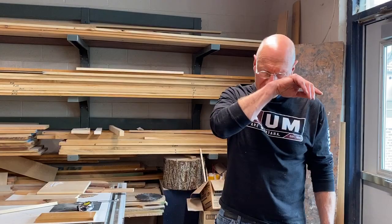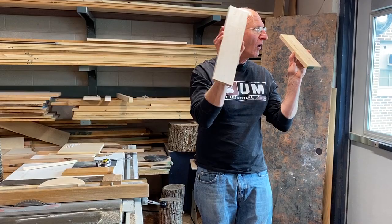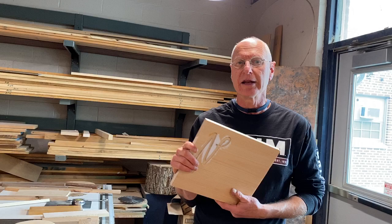Now here's the story — I said it was two and seven eighths. I don't know that it's exactly two and seven eighths. All I know is that if I cut these boards and they're less wide than two and seven eighths and they're flopping around, my hole that I'm going to drill for the bottle to go in is not going to line up exactly center. So I want to cut my piece the exact width of that jig. I have two great pieces here and I don't want to take a chance on screwing up either one. So I'm going to get this old piece of scrap pine and test it first.